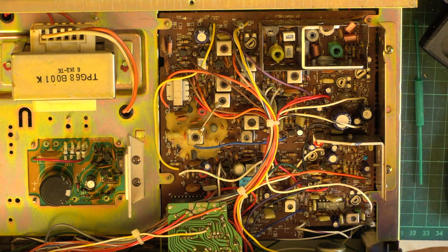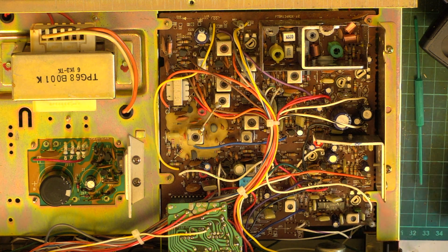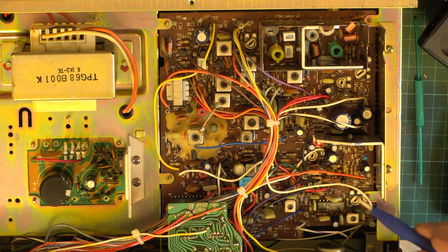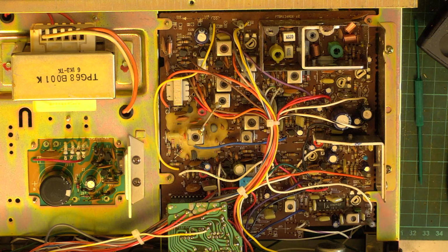So, with the T12 there, let's just see whether we've got maximum audio. We haven't actually. Okay. You can just end up with people a little bit garbled if it's only minutely out. And of course, these can shift in transit, which is a bit frustrating. There's a cobweb there. That's great. So that won't affect the Sinad reading, but it can affect intelligibility.